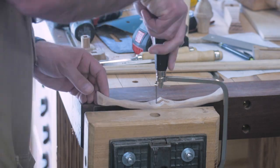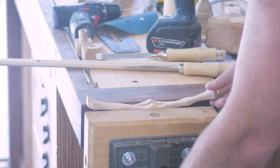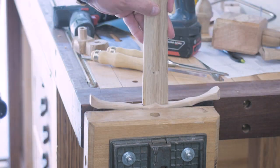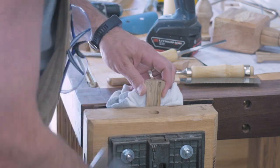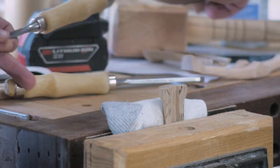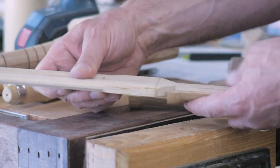I had to go in and cut the taper, because I prefer to taper the blade to the tang. It gives a little bit of a stronger connection between the tang and the blade, as opposed to a straight-off cut. Cutting that taper in so things will fit together nicely — there's still a little bit of taper that will extend into the handle, so I just need to cut that into the handle itself. This will help create a really strong connection all the way through the crossguard and the handle.